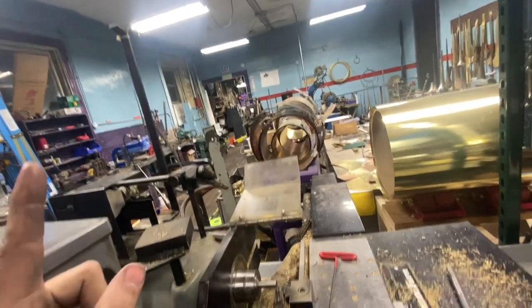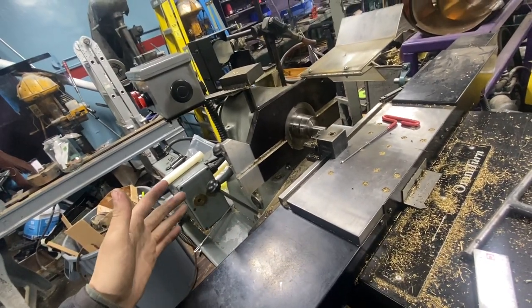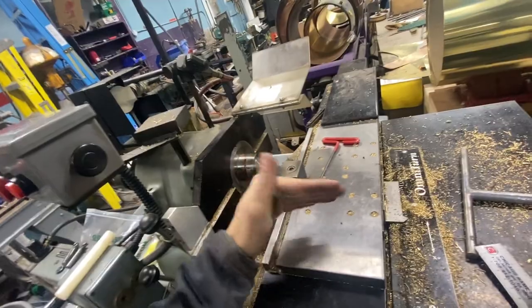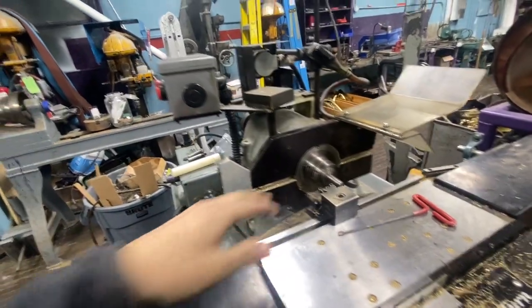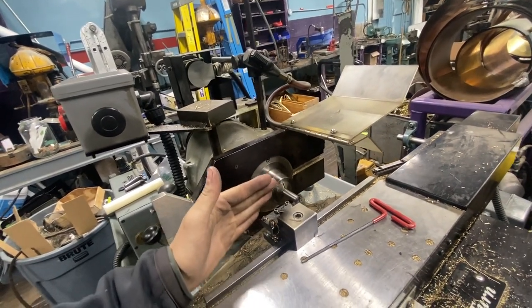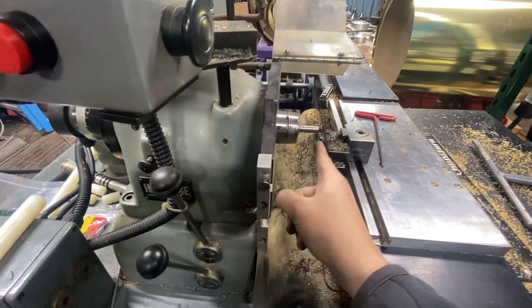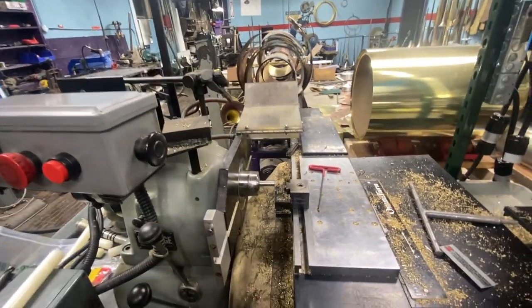The easy answer is you can't stick out nine inches on a little chucker lathe like this because it would just chatter. The astute among you might be saying, what about Swiss lathes? This is not a Swiss lathe. How Swiss lathes work is they don't actually use collets - they use something called guide bushings. They're much more expensive, complex machines, but in all intents and purposes it's similar, except your tools in Z are rigid. They don't move in Z; your tools only move in X. Usually there's a gang block here and a gang block here, drills, and two spindles. You have a guide bushing - it basically clamps on the material, but the actual spindle assembly moves in Z. So your spindle moves in Z, not your tools. What that allows you to do on a Swiss lathe is make a mouthpipe mandrel, keeping your tool stable in Z and only moving the taper in X. Your spindle would push the material out into the cutting tool, giving you absolute rigidity in your cut.